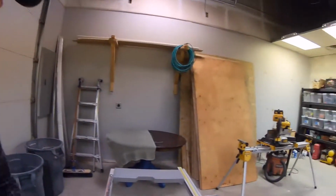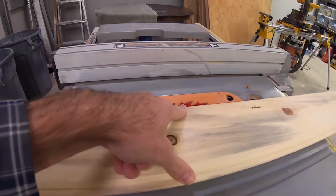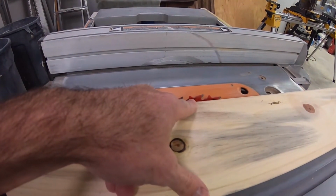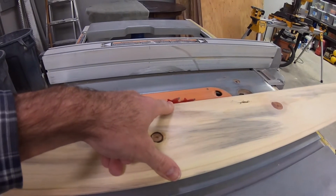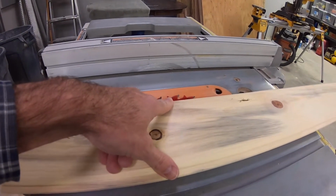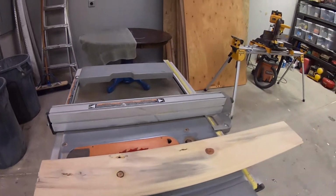All right. Table saw safety real quick. The trick with not cutting your fingers off and being safe with table saws is making sure that the blade height is the right height for the material you're going to rip or cut. So first key is to make sure I've got the tip of my blade just above that wood, so when I rip it, I don't have any kickback or any other issues that come with it. So make sure that you keep the table saw unplugged, size up your blade to the right height of the material you're working with, and then you should be good to go with every other thing running safely.